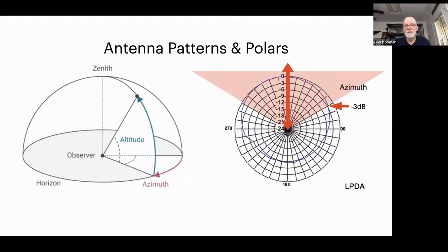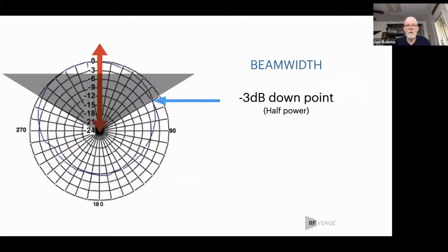When you're looking at aiming your antenna, the coverage area is what we call the beam width of the antenna — something like this would be a paddle antenna. It's not completely dead behind it, but the power is way reduced. So it has some pickup behind it, but not a whole lot — it's basically picking up in a forward direction. With an omni antenna, it would just be the whole circle — pickup in 360 degrees.